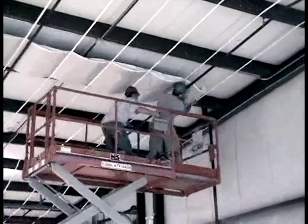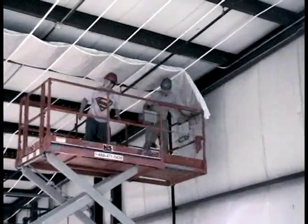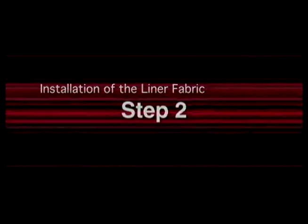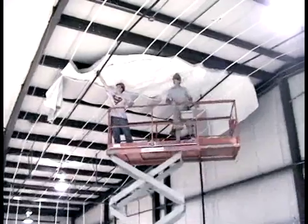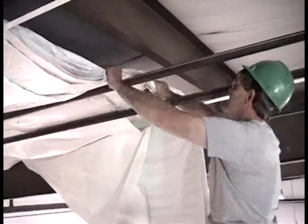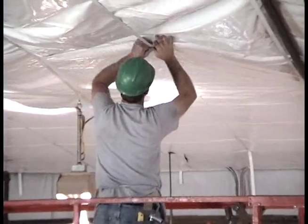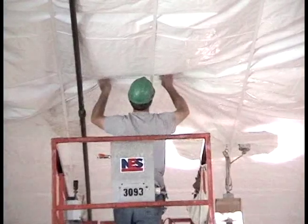Steel straps installed one inch from rafters are not used until insulation is pulled into the cavity. Pull suspension fabric toward the ridge on the platform of steel straps. Pull fabric one purlin space at a time and install fasteners through each band and fabric into the purlins, or it may be pulled several purlin spaces and attached at the furthest purlin — then you must come back and install all the fasteners in between. Smooth out wrinkles and install the balance of needed fasteners. Always install fasteners in the center of the purlin first, then go each way from the middle, pulling away from the middle to remove slack in the fabric and minimizing wrinkles as you fasten.